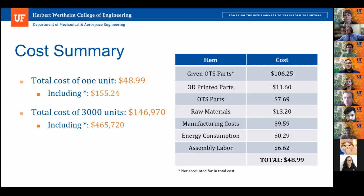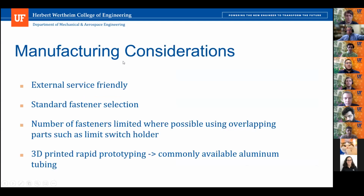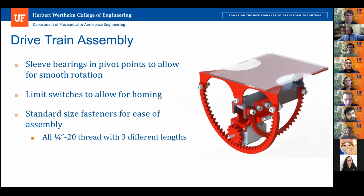And one more thing, for the gears, what material was it? Were those just 3D printed? Yeah, they were 3D printed. In general, all the red components that you see on the design are 3D printed. Okay. I was just wondering if you did any dimensional variation analysis, looking at the alignment of the gears and any issues with assembly, and also at the contact stresses, and whether they would break if hit by a rock or something, like any forces in the thin direction.